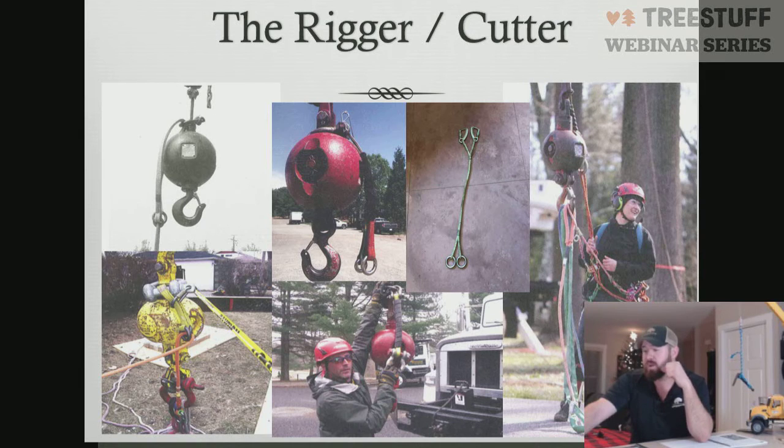And also, you really want to make sure, ideally, that your tie-in point as the climber is hanging below the overhaul ball or the block. You really don't want to run into a situation where the climbing line comes in contact with the ball or the block and gets pinched or cut or something like that. So you want to make sure your rings are hanging down, generally speaking, about level with the throat of the hook. And that's also where you'd be for your hoist position as well.